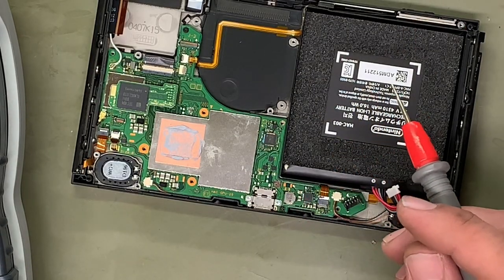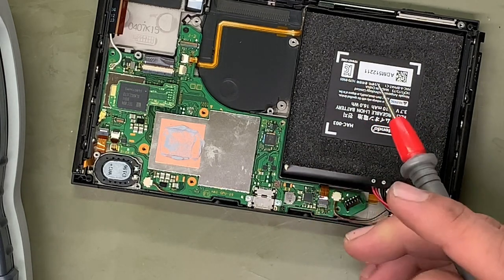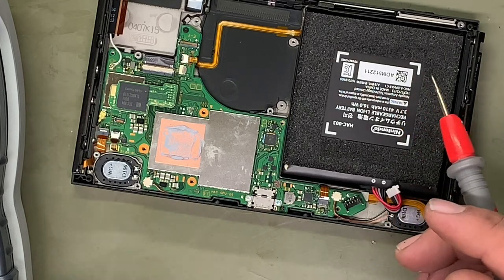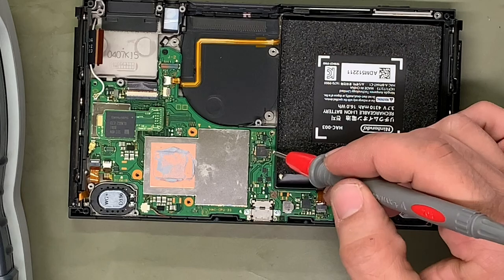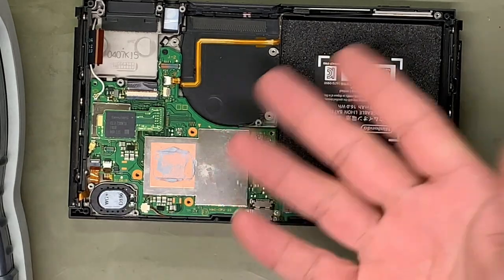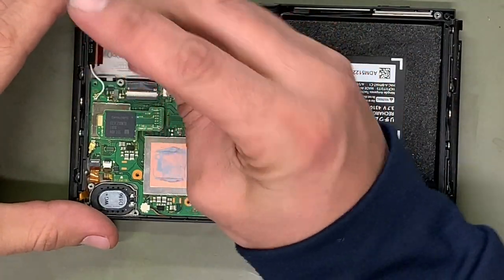The charging port that he did seems to be okay, because you are getting some volts. If you got a connection, you're gonna get the correct 14 or 15 volts. He's getting 5 volts steady, so something is telling me that something is definitely shorted there, which of course we already know it is because we already checked it out.